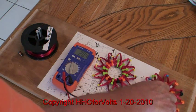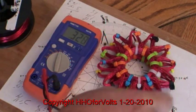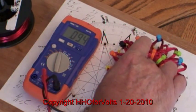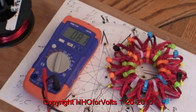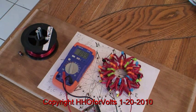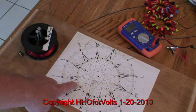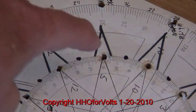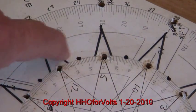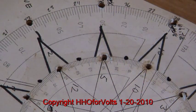Let's go ahead and put one on top of the other — notice they add. Flip it over and they divide. This is very interesting; this is one of the first tests I've made on how the fields are interacting. I'm going to modify my jig — I'm going to add pegs. I've already marked it for drilling additional holes. These will be wound in the opposite direction and the windings will be interwoven between the two coils, and we'll make some tests with that.